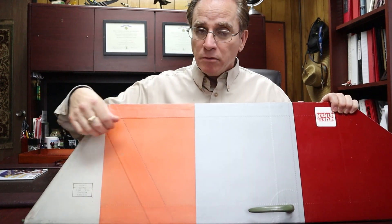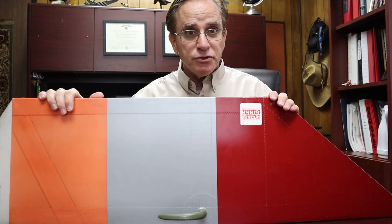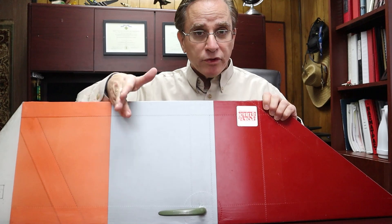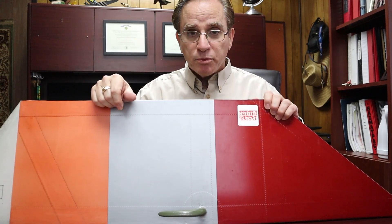After that, first order of business: brush on a coat of poly brush, then spray on two coats of poly brush. Let that dry a couple of hours in between each coat — one brushed, two sprayed. Then you're going to spray on one cross coat of poly spray, north and south and then east and west. Wait two hours.